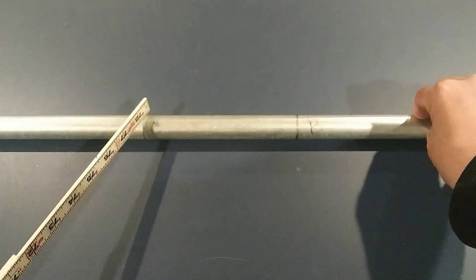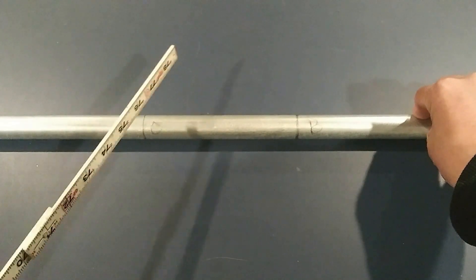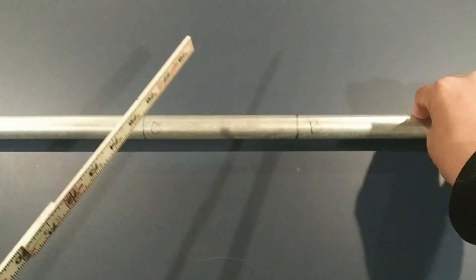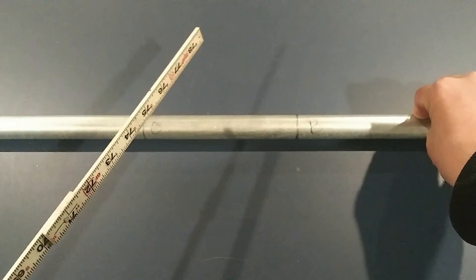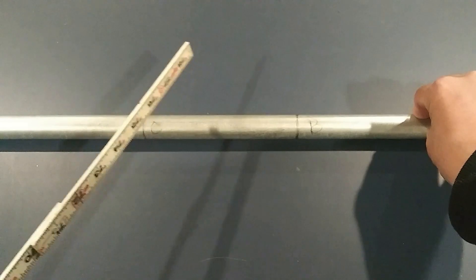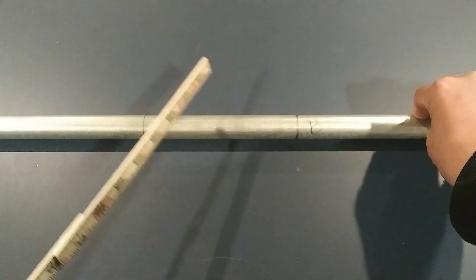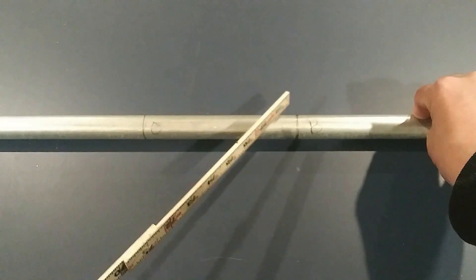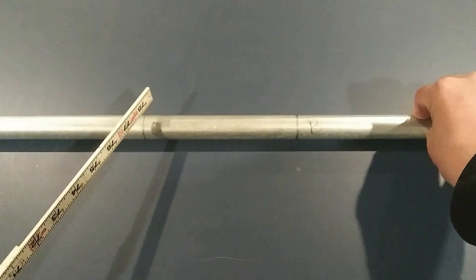We have spacing in between our first and our second offsets. The spacing — you can space it out as much as you decide. My suggestion is not to do it any less than six inches, because if you do it shorter than six inches the bends start to look a little funky, a little weird. You don't want that — you want it to look very neat. It looks pretty good at six inches; anything less than that is going to look a little weird.